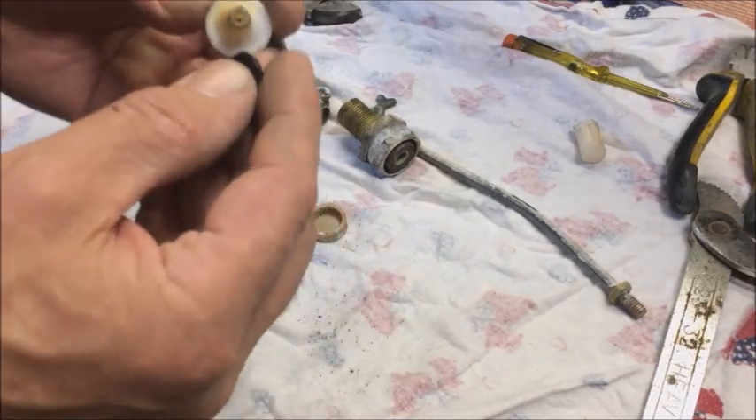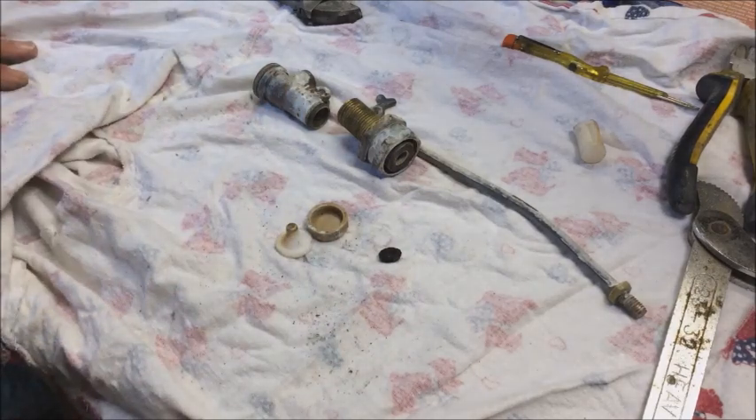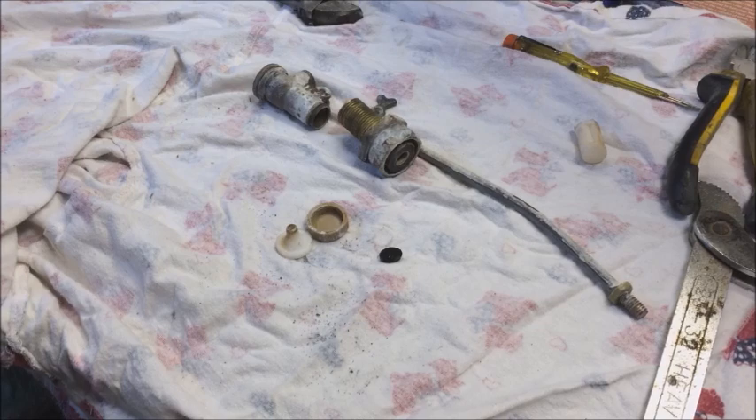And that is what caused my leak — or it caused water to continually dribble in, because that washer wasn't sealing that off so well. In fact, you can see it's actually worn a hole through it — that's supposed to be solid. So there we go. One job done. Right, so that was it — that's the ball valve, very simple affair. Caught me a bit of grief, but I didn't get a flood as such, and I got a little brass out of it as well.